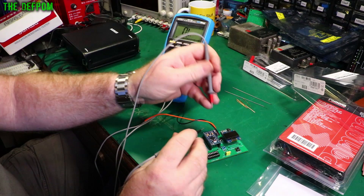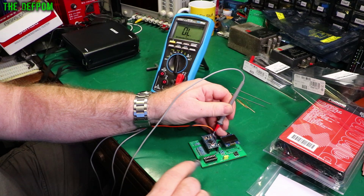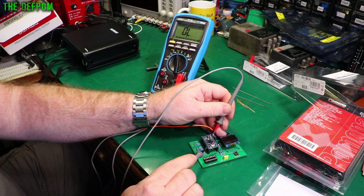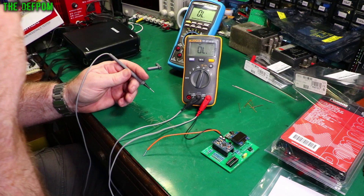Let's do the usual test — stick on a ground connection of this Arduino Pro Mini and run across to another ground connection. With these Pro Tips on my BM786, the continuity response is incredible — super fast. The BM786 is actually a fairly fast response meter for continuity anyway, but the probe quality contributes significantly.